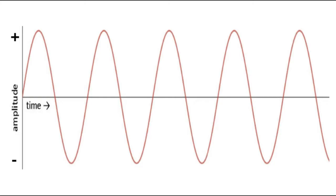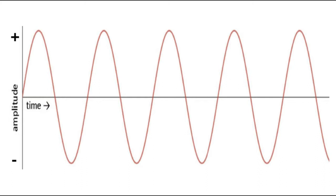The third way to make a fan go slower and reduce noise is to reduce the voltage going into the fan. This is the method I think is best by far, and it works very well — it both slows the fan down and makes it very quiet. This is because the waveform stays very smooth. Here's the original waveform, and when we reduce the voltage, the waveform is still very smooth. It has the same number of cycles per second, but the amplitude of the wave is reduced, meaning there's less energy in the electricity, so the fan will go slower.